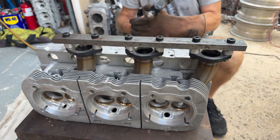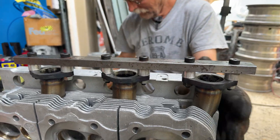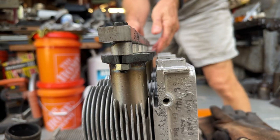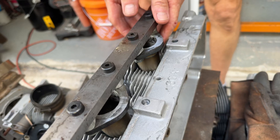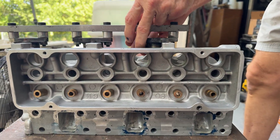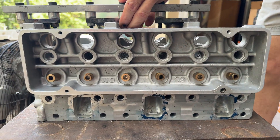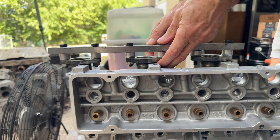So now we just have to make sure that it goes down. Once it gets to that position, it rings pretty good. Let's check — oh, they're nice and square. Look at that. What's nice about it is the position of these holes are all in line. We could have pounded the tubes in and welded the flanges on after, but you can't weld the underneath side in there. So to do them properly, you've got to weld the flanges on before you pound them in.